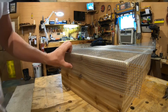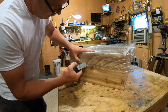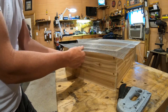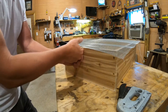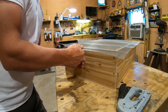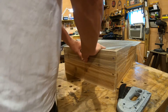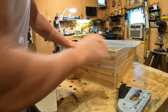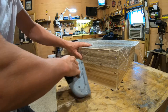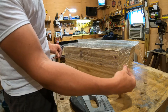Get the staple gun loaded up and staple this down. Once one side is stapled, spin it around - pull the screen tight and force that 90-degree bend down so you don't give up any slack. Pull it tight and get a few staples in there. Then we'll work the corners and show you how we do that once we get this stapled.